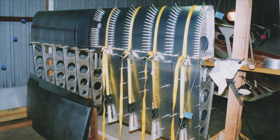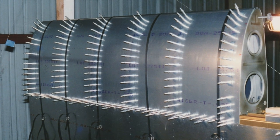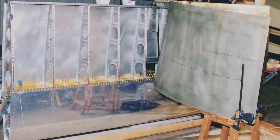If Rosie the Riveter could do it, so could I. October 16th: deburred all holes in main and forward ribs, rear spar including machine dimpling and support angles. Next, deburr edges. October 20th: use die grinder Scotch-Brite wheel on all left wing ribs and angles.